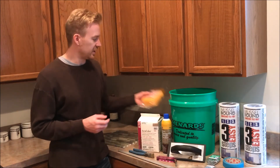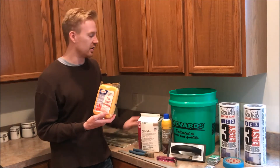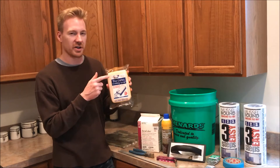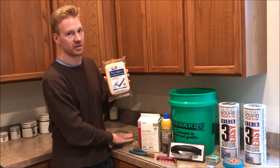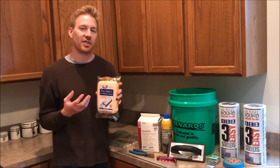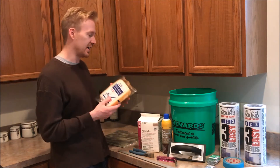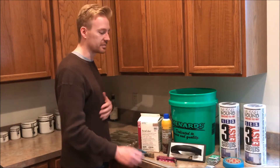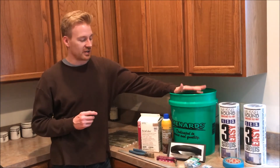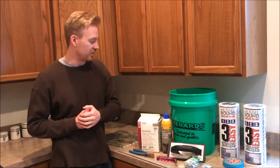Another thing you'll need is a tile grout sponge, used to clean the grout off the backsplash after application. I got one with a scrubbing pad on the back — a white, more abrasive area that won't scratch the backsplash but does remove the haze after the grout's final drying. That's not completely necessary; a towel or microfiber cloth could also work. And don't forget a bucket — if you're using thinset or mastic, get two buckets. I'll use one bucket for the grout.